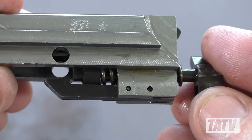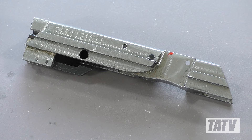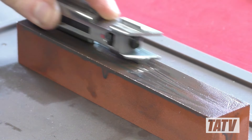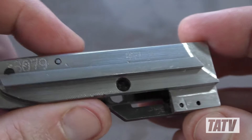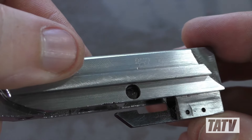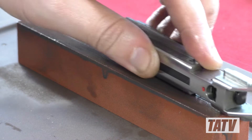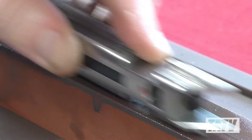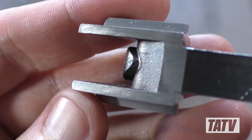With the safety addressed, we can now go ahead and remove the ejector, ejector spring, and collar, all of which should pretty much just fall out on their own. With that done, we finally have the bolt in a state we can begin to work on it. Once again, we'll be using a combination of medium and fine India stones with a generous amount of honing oil. We want to pay extra close attention to each of the bearing surfaces, slowly stripping away the excess material, removing the tool marks, and softening out the nicks and burrs. Emphasis here is on repetition, not force — we're applying very little pressure and relying on the existing angles to guide our work. The result is a fully finished bolt with smooth, polished bearing surfaces, dramatically reduced friction, and vastly improved fit and function.